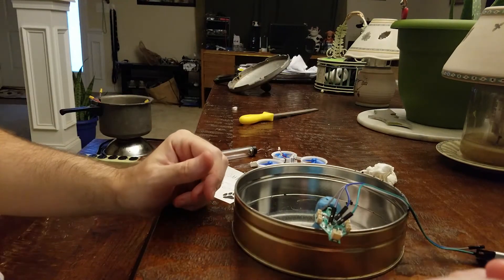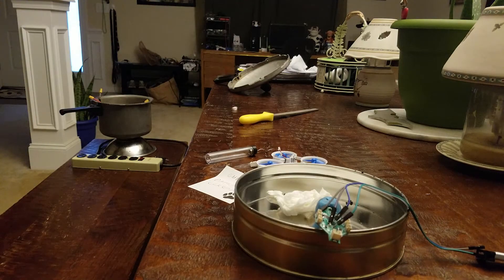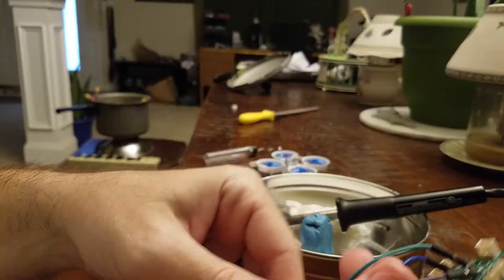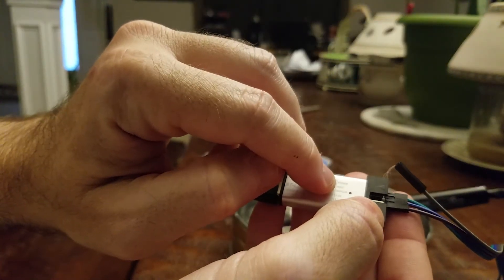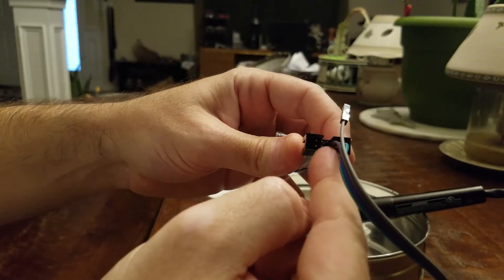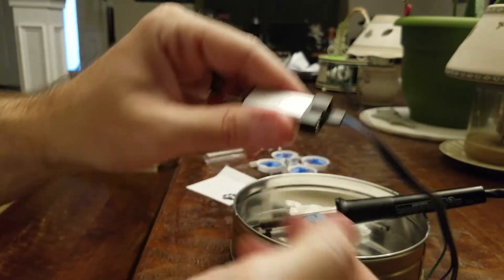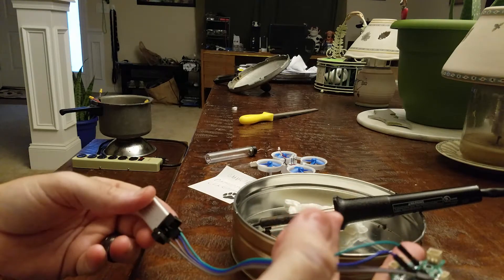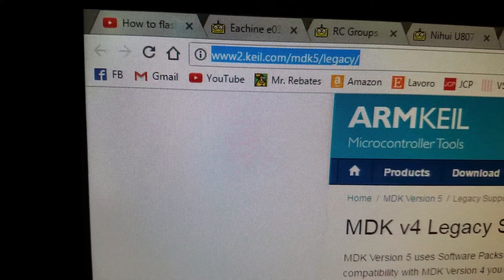There we go. I'm going to turn this off and clean my tip - I had to file my tip down to get something small enough. It's not the prettiest but it only has to hold for a little while. So on here we have SWDIO, ground, SWCLK. When you look at it, it's the bottom three right pins. USB, bottom three right pins: DIO, ground, CLK - goes to ground, DAT, and CLK. SWCLK for some reason doesn't go to CLK - who knows. I had way more trouble than expected; I had like an hour of video just to figure out which software.